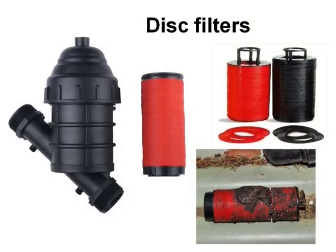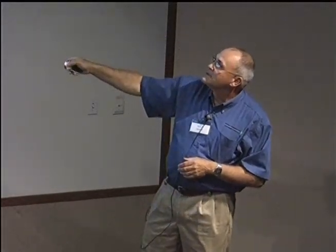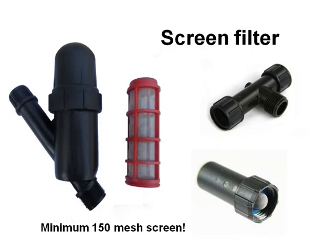As you step down — after you get the major junk out — and you're looking at removing silt, that's where disc filters come in. These little discs have small slits running from the inside to the outside, giving you much more surface area to screen silt than a regular screen filter. You stack these discs and get a lot of surface area both horizontally and through the depth. Excellent filters for silt. And then the standard screen filter — if you're going to get one, go with 150 mesh. That's a safe mesh size for getting most of the stuff out that's going to clog your emitters.